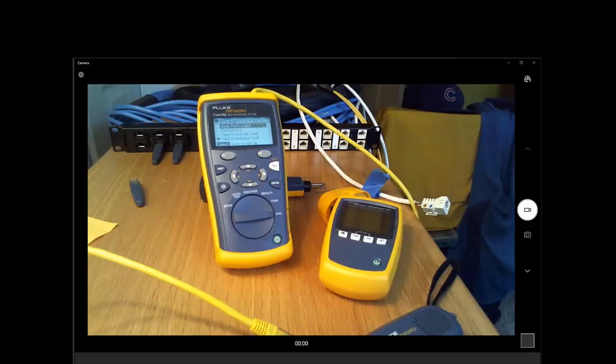Okay. I'm going to throw out one more of these stump the expert questions, and this may be one we can't answer, but we'll give it a shot anyway. This individual had a circuit that passed 1000BASE-T qualification on the cable IQ. However, when connecting to the access point powered by PoE, the link with the switch would not auto-negotiate to 1 gig, only to 100 meg. And he says, I think it's a he, until today, we don't know what happened there. Any suggestions on this one of what might have caused a problem like that?